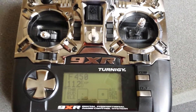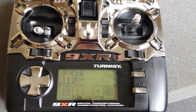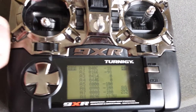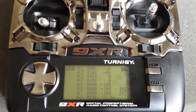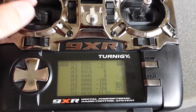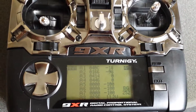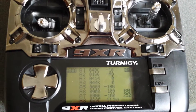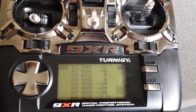I think there's something wrong with the left stick gimbal or the sensor inside that's reading that value. The other thing I wanted to show is that on screen 4, it looks like A1 and A2 are the left stick. So it's all the way down and in center, and I'm seeing a negative 18 — which would be for the yaw — and negative 98 for the throttle.